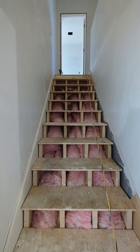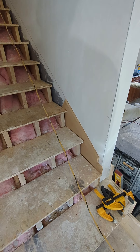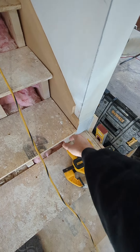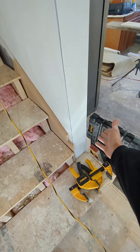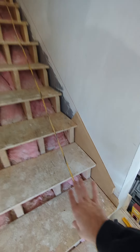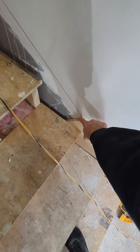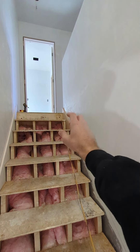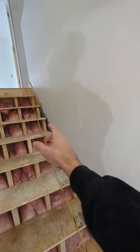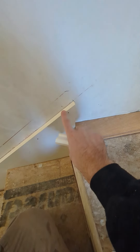I'm doing some stairs and railings for my buddy, and obviously it can be intimidating — even for me, I haven't done them in a couple of years. I like to make templates; that's going to allow me to dial in my miters top and bottom and all my notching. Once I tack the completed templates onto the wall, I just measure between these two points, take them off, tack one to the stringer skirt, measure, then tack the other — and that's going to make it perfect.